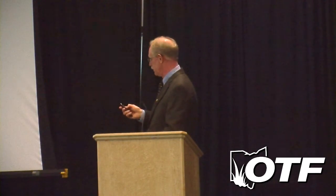You're looking to capture groundwater. If you capture groundwater around your bunkers, which is the topic today, you're going to be handling a lot of your other problems that you have. Groundwater captured is the most efficient way to handle rain events, because if your soil isn't saturated, that water is going to run off and soak in also very readily. The problem is under the ground most of the time, not what lands on top of the ground in rain events.